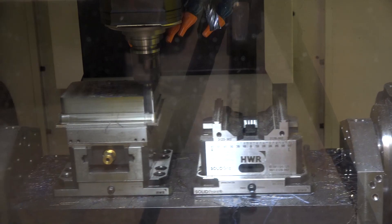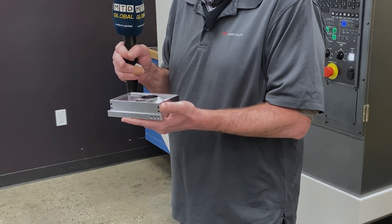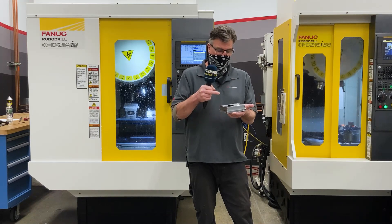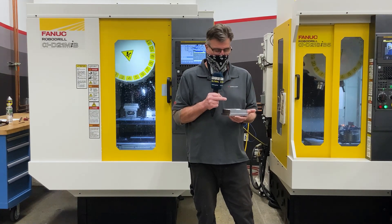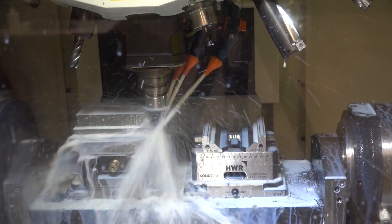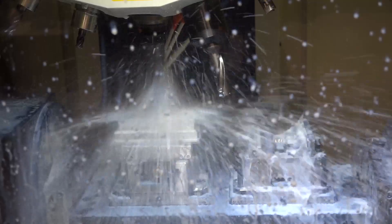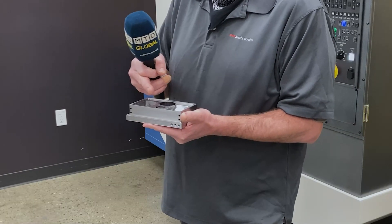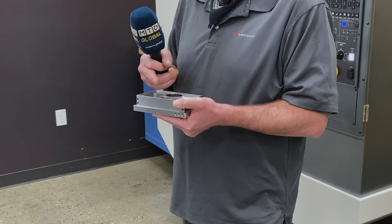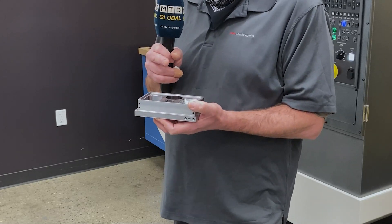All dynamic milling, so it's cooling the chips as it cuts, at a high rate of speed. Then it'll finish with just a small cut to get the good finish that you want. Then we got the 40 millimeter drill through the coolant, plunges it one cut, G81, boom. And then we have another drill for this tapped hole, very large tapped hole, M20, through the spindle coolant drill for that one. Over here we're using the feed mill, hogging out all that material and the two ovals at the bottom, as you can see. And then this one here, we hog out the material, and then we use that ball end mill for the finish you see here.